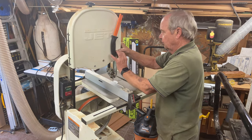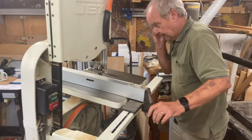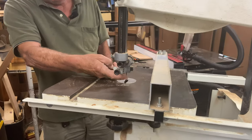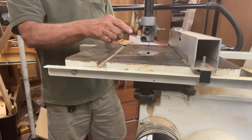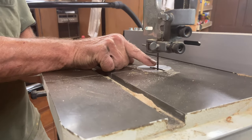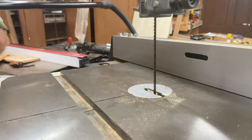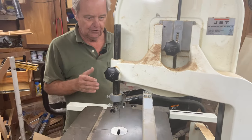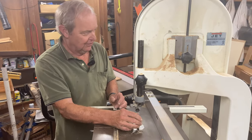There are several factors in what kind of blade you pick. This happens to be a quarter inch blade, meaning it's a quarter of an inch from the flat back to the end of the pointed teeth in the front. Blades differ in their depth — this is a quarter inch — and they differ in how many teeth there are per inch. You change those out depending on what kind of cuts you're making: a cross cut versus a rip, and a rip through a thick piece of wood, which is called resawing, would use a very different kind of blade.